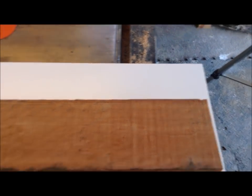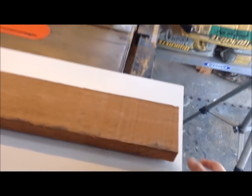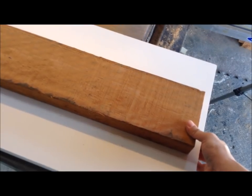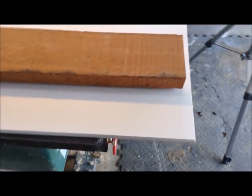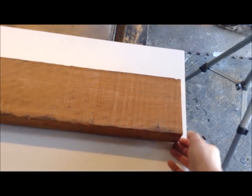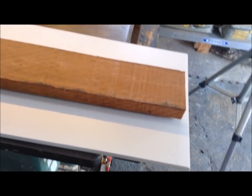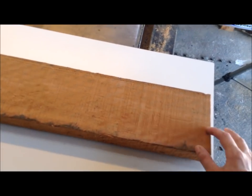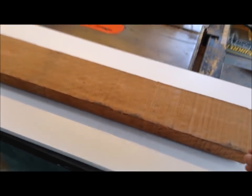This board here has a big bow in the middle. You're going to shim underneath so that when it goes to the planer, the rollers can't push it down. You would think you could send these through the planer and it will flatten them, but it won't — those rollers will push the board down, plane it the same thickness across, and then when it comes out the other side it will spring back up with that bow. By adding shims you make it so the planer can't sink the board; it takes down the high spots on each end, and once the entire surface shows it's been planed, you know it's done.